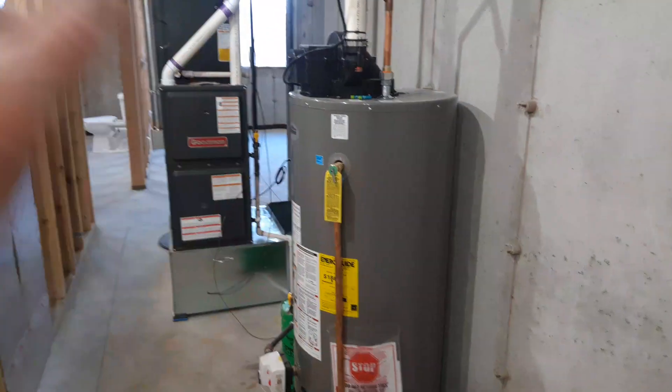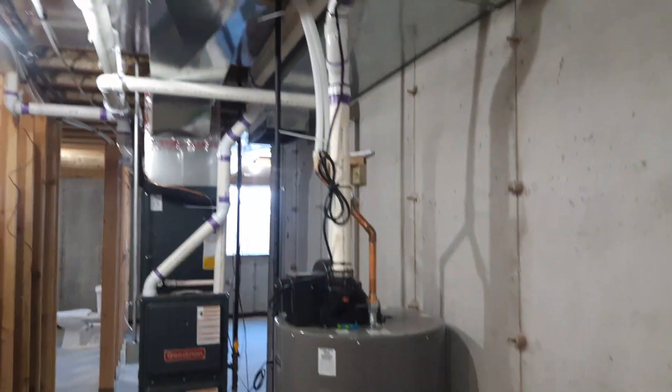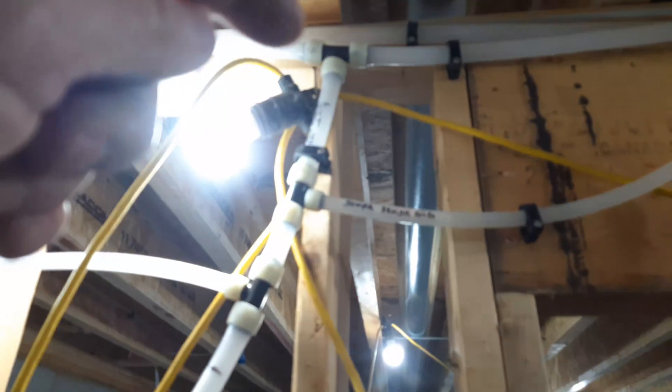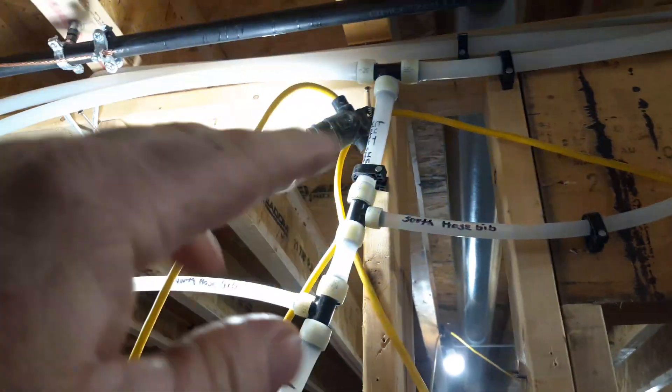This is like a 45-minute refresh rate for a 78-gallon water heater — it's nice and clean. You've got a full 3/4-inch line that feeds all your fixtures. South side hose bib, north side hose bib. And right here, if you wanted a water softening system, you simply splice right here, put two 90s, fish them up and over, and put it on this wall. But we're not going to do it unless you pay for it.